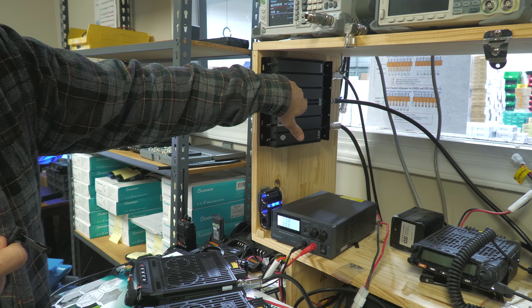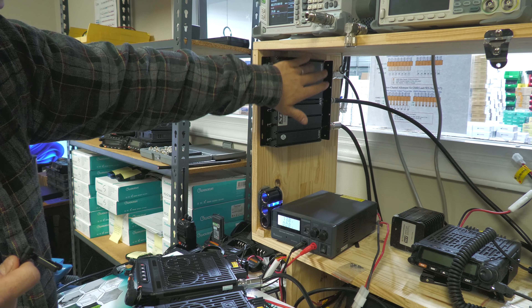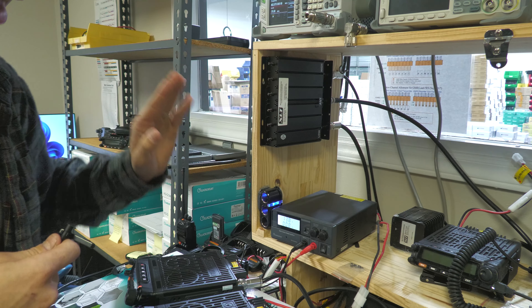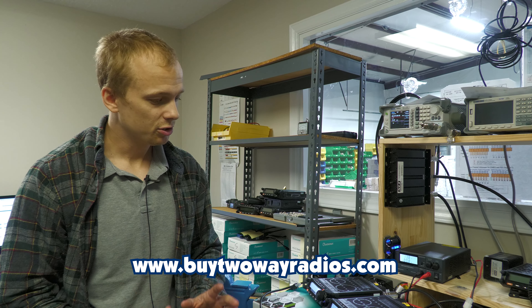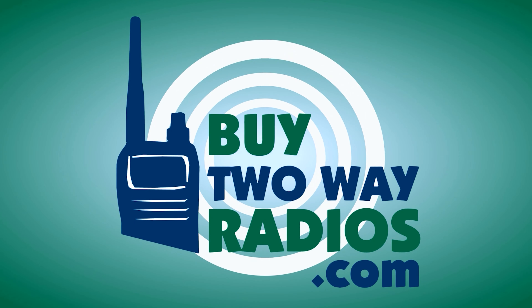The repeater receive radio is meant to receive on 467, so it allows 467 to pass through — that's the high frequency. As you can see on this duplexer, the skinny cord is on the high side of the duplexer, which is the repeater receive at 467.700. The repeater transmit uses the thicker cable, which you can see connected on the repeater transmit side. That middle cable goes to our antenna. So to recap: the high frequency 467 is the receiver, the lower frequency 462 is the transmitter, and in the middle is the antenna — that's how we have it set up with our GMRS duplexer.